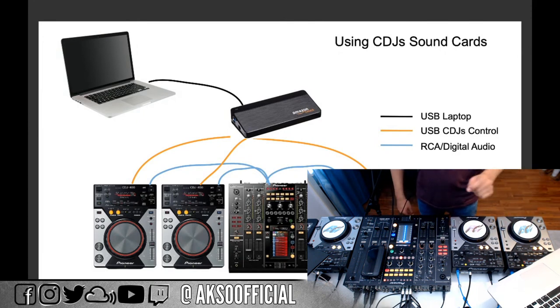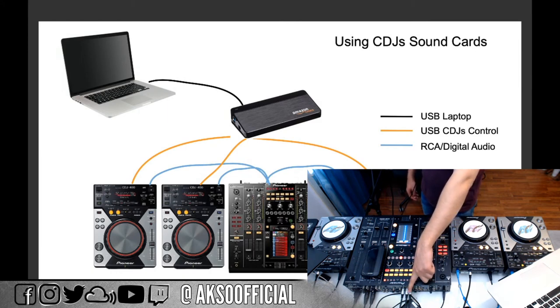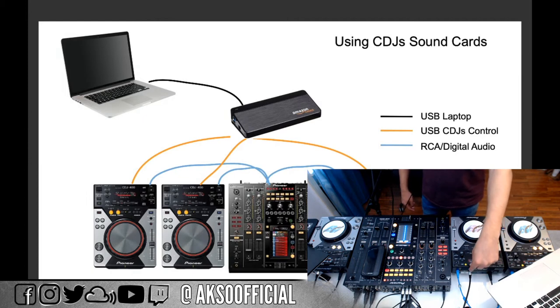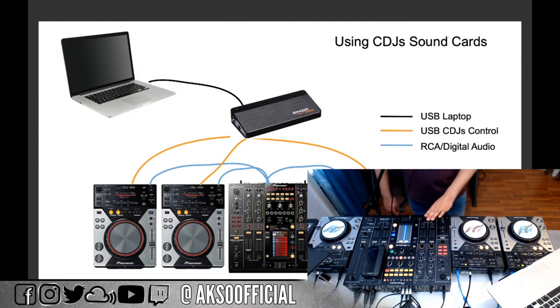The blue cables are RCA or digital cables. They come out of the normal outputs of the CDJs and into the mixer. In this case I'm using a digital coax connection. Through testing I found that on this particular unit the digital output is much cleaner — I used to get a little bit of noise running RCAs because they're connected to the same circuit as the power supply. On the digital ones it's perfect. So if your mixer allows digital, just run that — unless your mixer has a built-in sound card, which we'll talk about in a second.